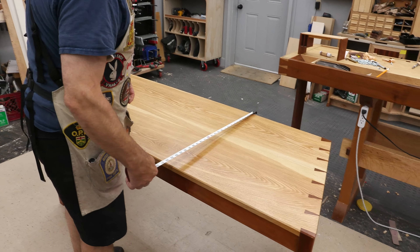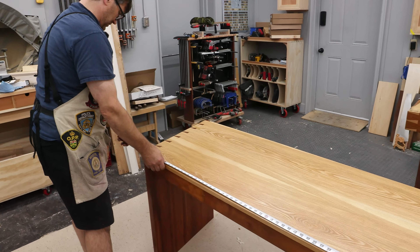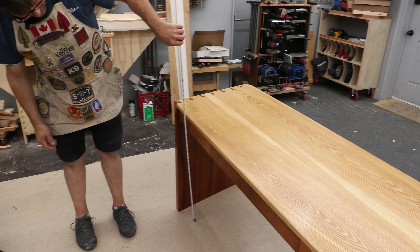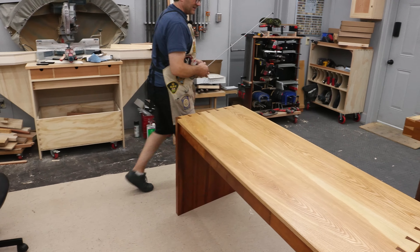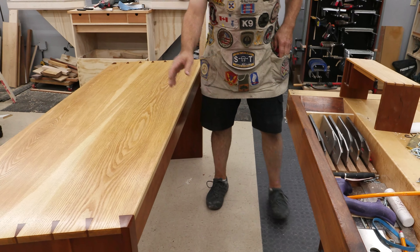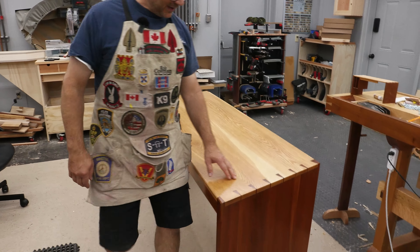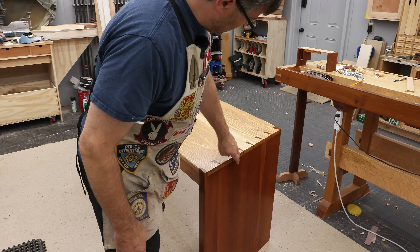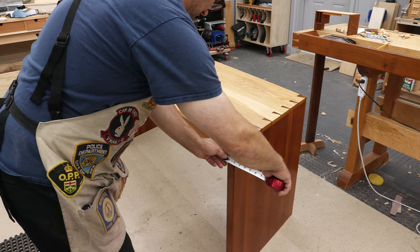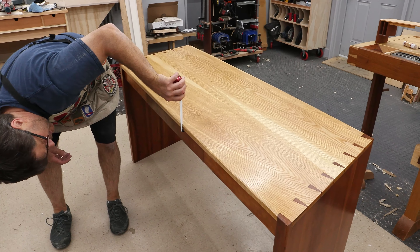The desk is 24 and a quarter inches wide, and the overall length excluding the angle is about 70 inches long. Height is standard desk height — 29 inches. Underneath the front apron where you would sit, you've got 25 and a quarter inches, with a modesty panel in the back and 23 and a half inches behind there. The end pieces are an inch and three-quarters thick, and the top is 13/16 of an inch thick.